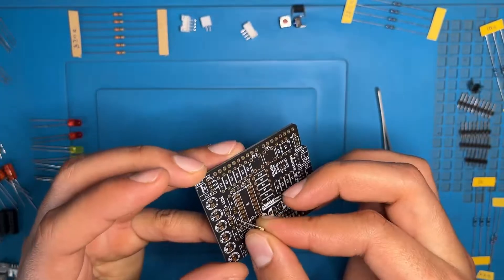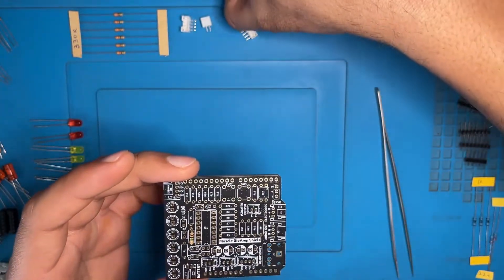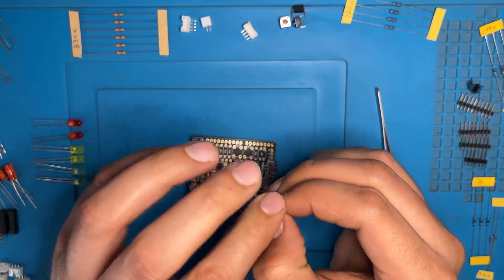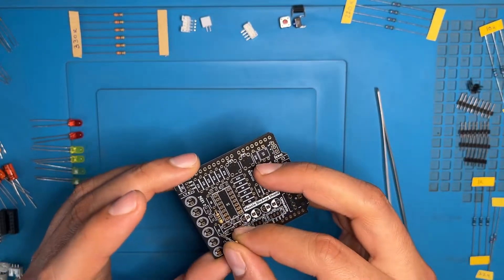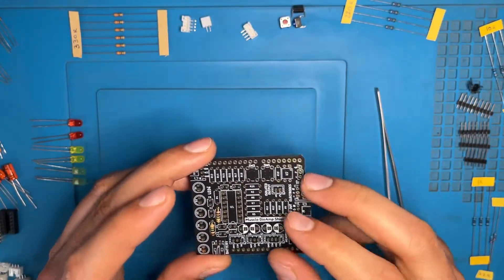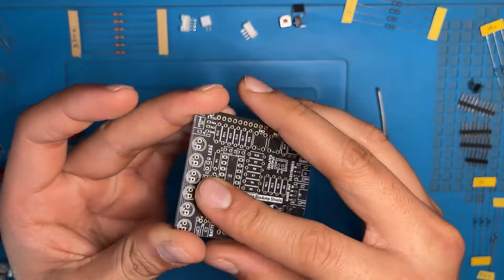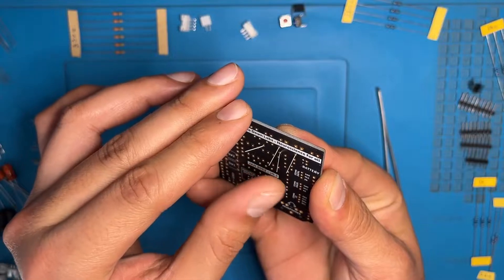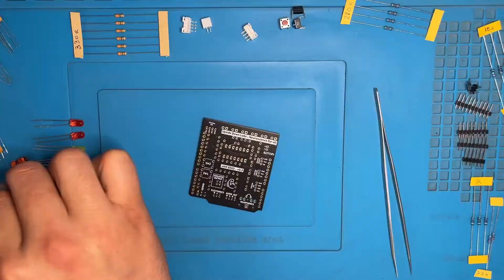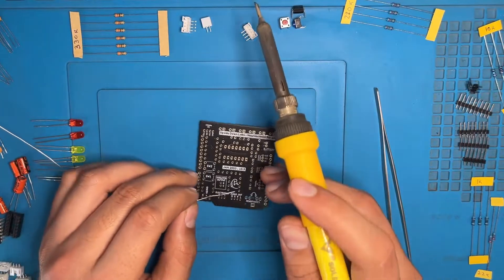After this, insert it in location R2. Turn the pins inside from both sides and put them in the other location R1. After this, place your finger on the resistor like this, and turn the PCB upside down and pull the pins apart. This will help you prevent your resistor from falling from the PCB. Solder your components with an adequate amount of solder. Do not injure yourself.